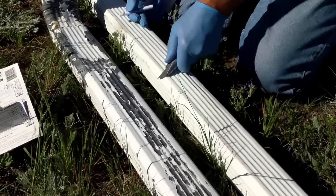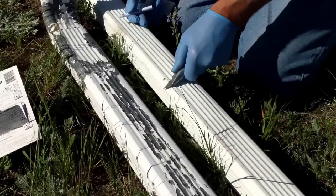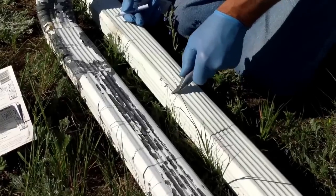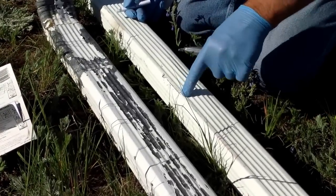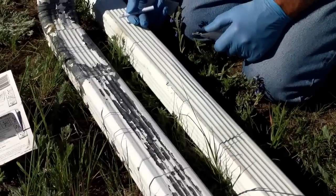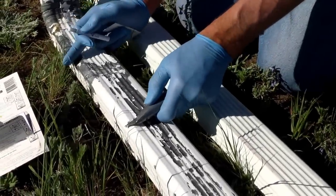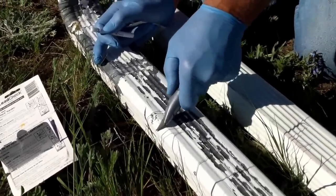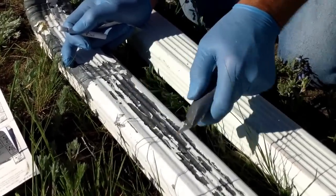The way you prepare is you scratch it, and I pick a corner so that I get down to bare metal. I also come across and get all of the layers, so that when we swab this in a minute, if there's multiple layers, we'll see little rings.